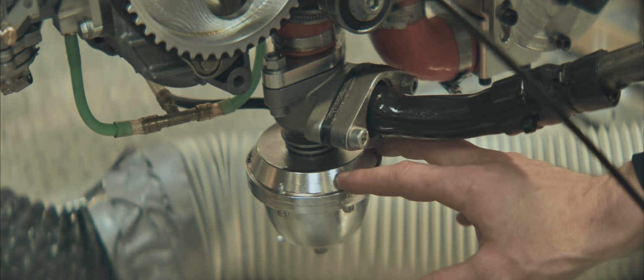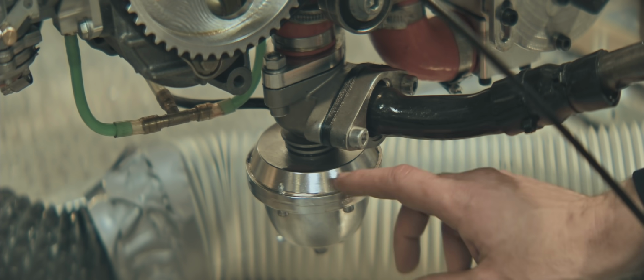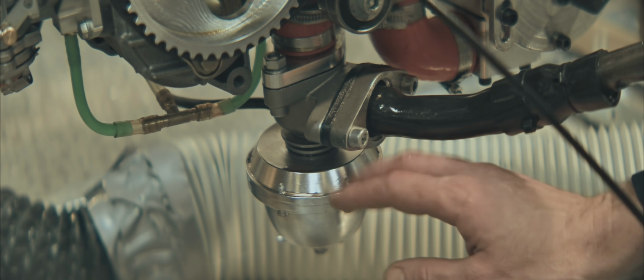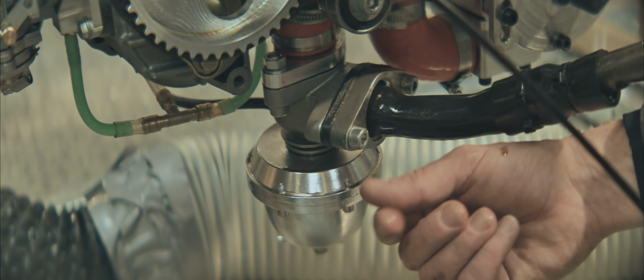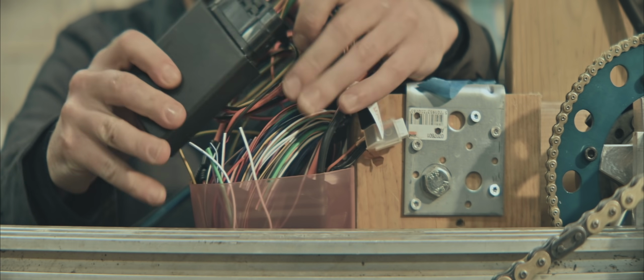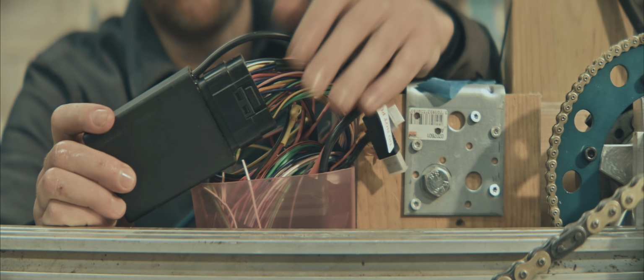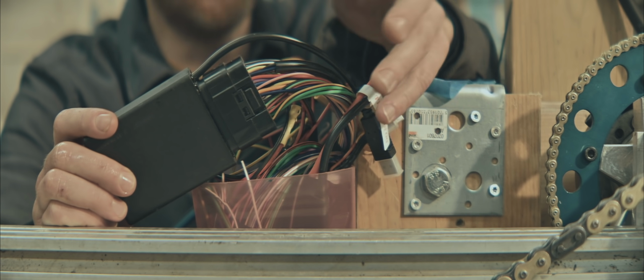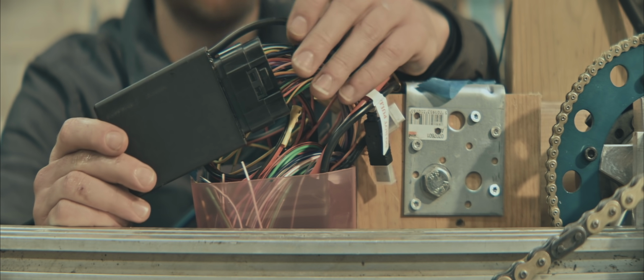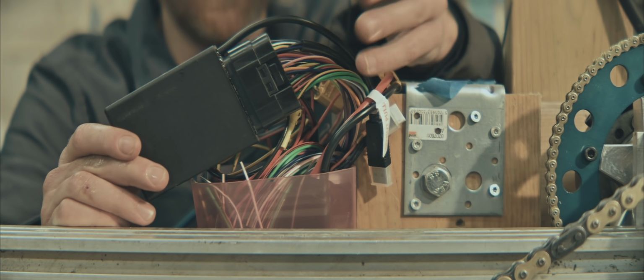Boost pressure is currently set at the lowest I can go with this wastegate. 0.3, 0.4 bars. Should start shimming the spring, giving it more pressure. Or add a boost controller, electronic or just a bleed valve. Ignition timing is set to a 15 degrees flat line. That's probably far too little advance. I have a suspicion this will act more like a 4-stroke without the pipe and all that. Probably need to up that to closer to maybe 30, 40 degrees, maybe even more with the nitro and stuff.